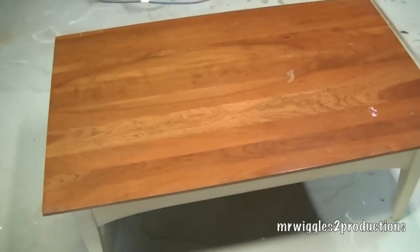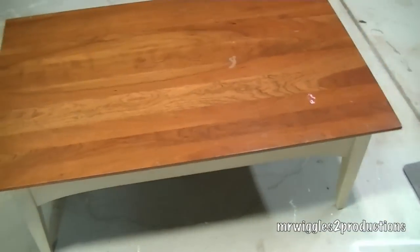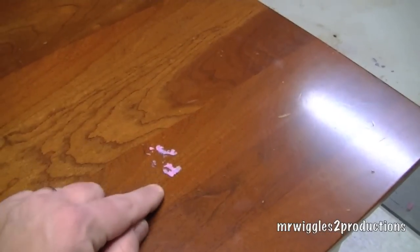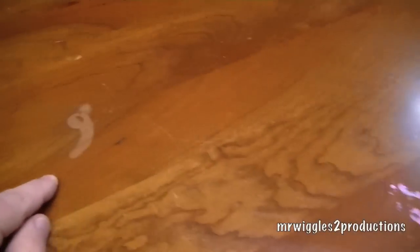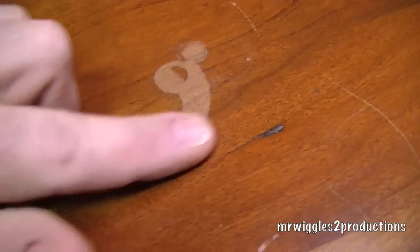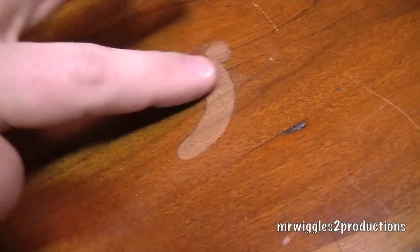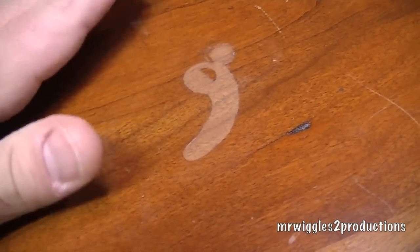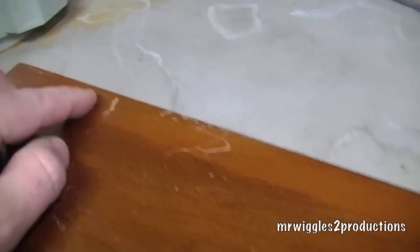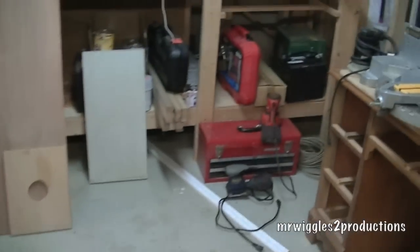Hello YouTube, today we're going to be refinishing a table. This is a solid cherry top table with painted sides that I believe, based on the wood I can see, is probably poplar. We've got some nail polish here and what looks to be a ring — half a ring from a scotch glass — and it burned right through the finish, which tells me this is a shellac finish. There are also some scratches down through the shellac.